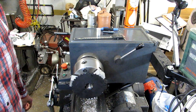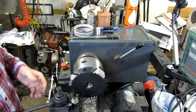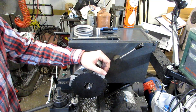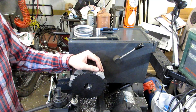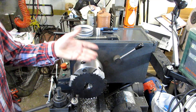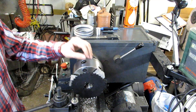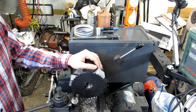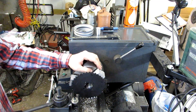Best of all, everything's nice and concentric. From here on out this is just a straightforward boring job. I've got plenty of clearance to break through this part because of the pocket that already existed in these jaws. And of course if you needed to, you could bore right into the jaws — they're aluminum, so they're not going to hurt your tool any more than your part will. Soft jaws are a fantastic option for not only production work but for odd-shaped pieces like this. If you've got something that's just really hard to hold in a standard way, consider soft jaws. They're not that expensive, and of course you can make them yourself. If you're doing production work and have a lot of parts to make, you can make these out of steel so they'll last a little bit longer. Otherwise aluminum is a really fantastic and cheap choice. I plan on doing a video in the near future on making your own soft jaws, so keep an eye out for that.